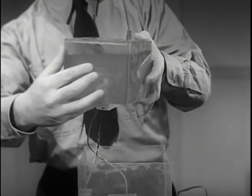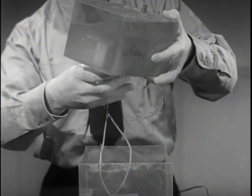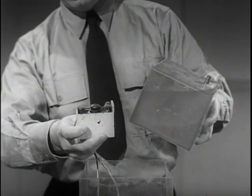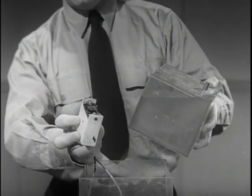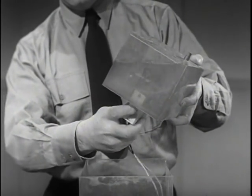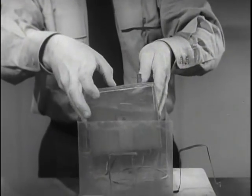The calcium chloride solution helps to ward off freezing of the battery at night and excess heating during the day. The battery, within a third box, puts out two volts and about 10 amps on short circuit. It is a lead-acid, wet cell type with five plates. Spacers maintain a uniform air space between the outer boxes.